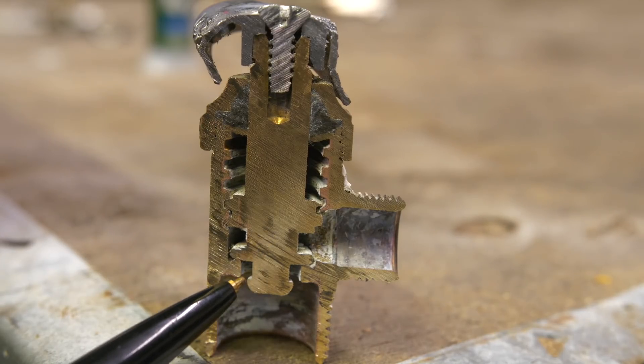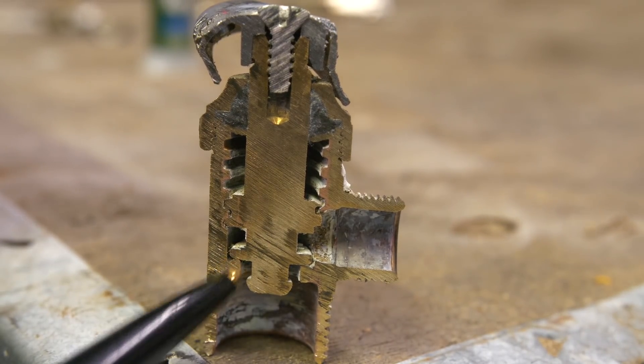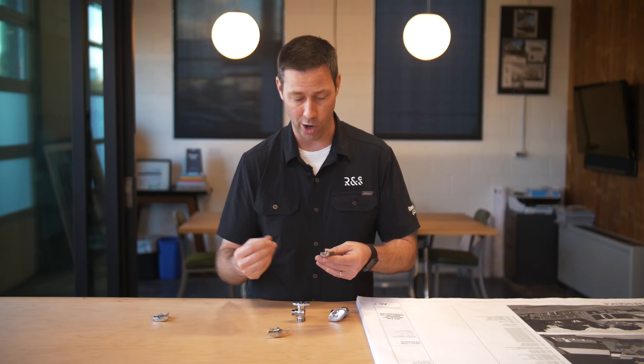It's possible it was kind of crumbly and maybe when we bandsawed this, that plastic got removed. But I think more likely is that over time, the chlorine in the water, mineral deposits, whatever it is, broke down that rubber that was forming that gasket, and now when I crank this thing down, it wouldn't actually shut off.